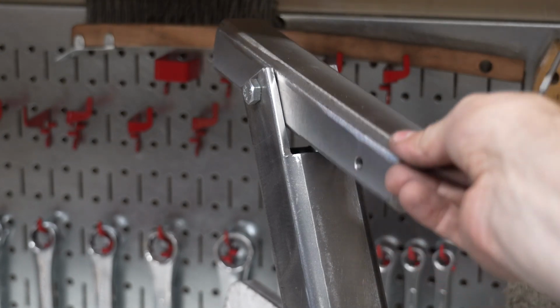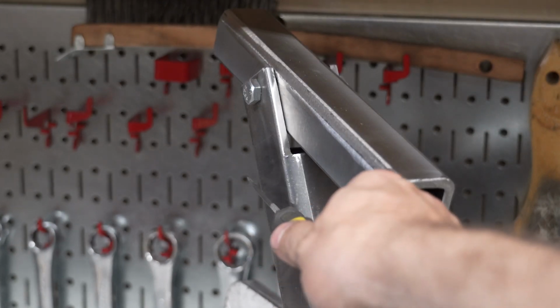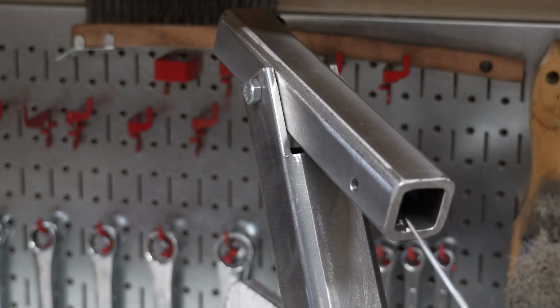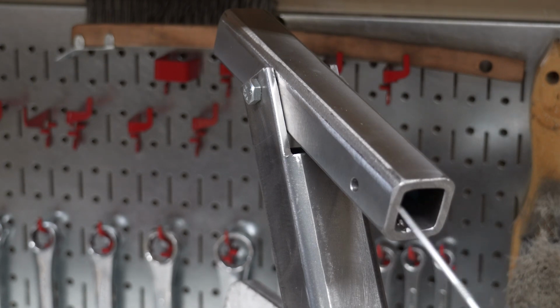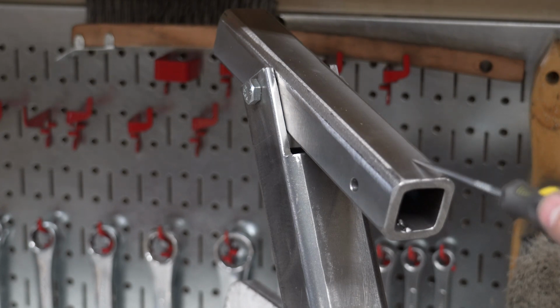All right, this is the tensioner arm. In the original plans, they have a spring that goes back here. I'm going to drill a hole back here and move this arm forward, and I'm going to put a gas strut on there. Some of the other plans have gas struts on them. I don't know if it's any better or any worse. I would think the gas strut just looks nicer, a little less cheap. Maybe it's still equally as functional. But my point is that I'm going to move this forward, put a gas strut on it, and then this will get a handle on it so that you can operate the tensioning arm, take your belts off, and put belts on. Then I still have to make the tensioner wheel alignment mechanism that will go here.